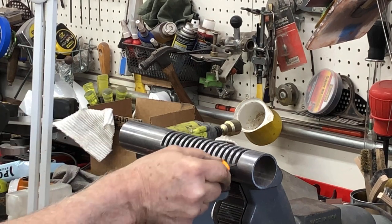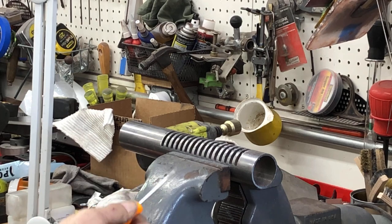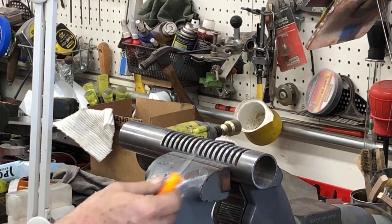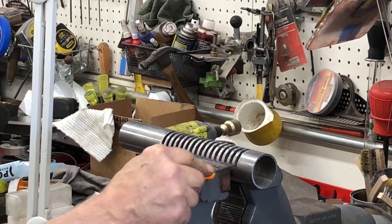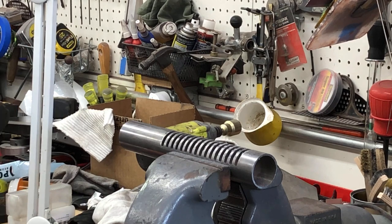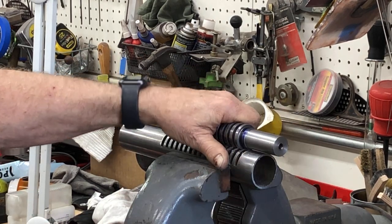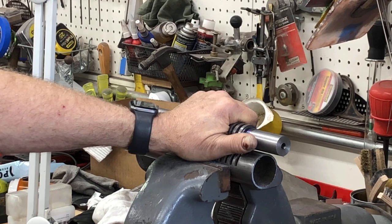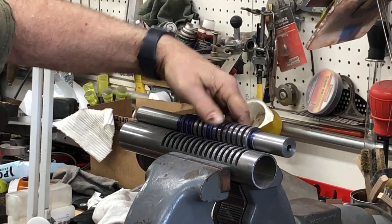I did the same thing with this piece of pipe. Now this is not regular pipe, it's carbon steel pipe that you can harden. But again, I just put a 5 millimeter groove, offset 10 millimeters, all the way down with a mill. So as anybody that knows machining knows, you can't put a 5 millimeter wide part in a 5 millimeter groove. It has to be bigger than 5 millimeter, just a little bit.